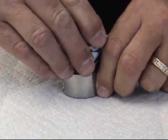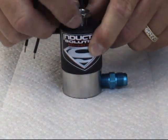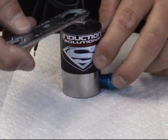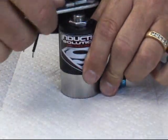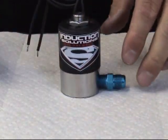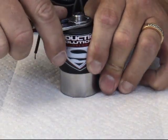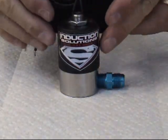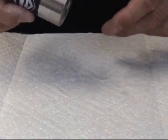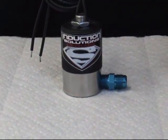Get them on and wiggle them back in place. Take your nut, run it back on the top, and snug it down with the other end of your wrench. Remember you've got a metal coil cover over the plastic coil, so you want to make sure it's tight enough that it won't come loose and fall off, but don't over-tighten it and risk breaking the coil. The solenoid is back in order, ready to go back in place and ready to function again.